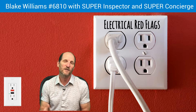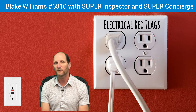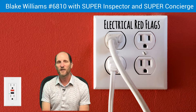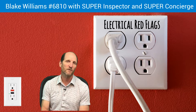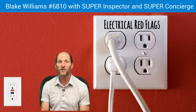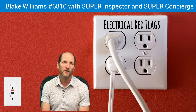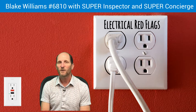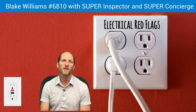Some may say this house is too old — it wasn't required, so it's grandfathered in. And that's true, but it is a safety item, so you have to be careful. If you tell your client they don't need to upgrade to ground fault circuit interrupters, and then they're using a hair dryer in the bathroom and drop it in the sink and reach in, they're going to get an electric shock. The next question will be, 'My realtor told me I didn't need to upgrade this.' Now you've got a liability on your hands. So always be careful about how you recommend things as grandfathered in, especially when talking about electrical.